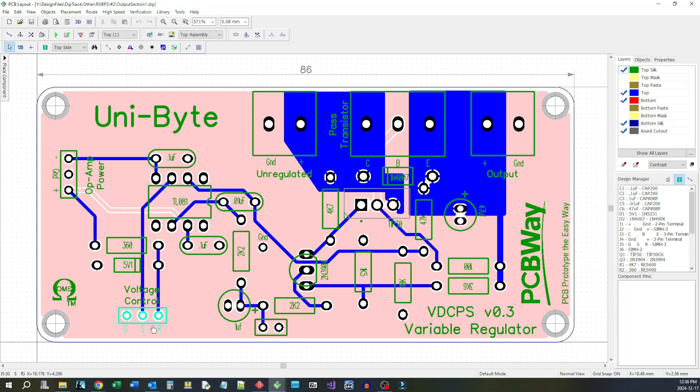When it comes back in we'll build one up and put it through some tests to figure out whether we're heading down the right road. Then the second phase would be to add some current limiting into it, and then we might spruce up the voltage reference a little bit by putting in an op-amp or a TL431 or something of that nature. Anyway folks, thanks for coming out — that's all I have for you today. We'll see you in the next video, and thanks again to PCBWay for making this project a possibility. Bye-bye folks.